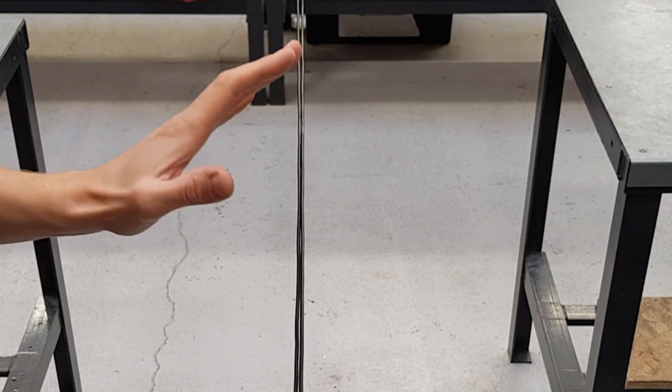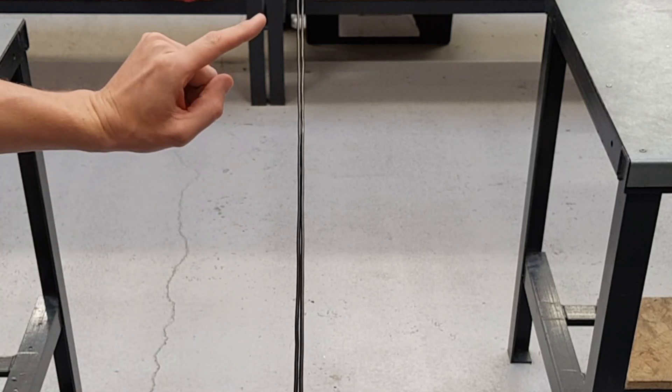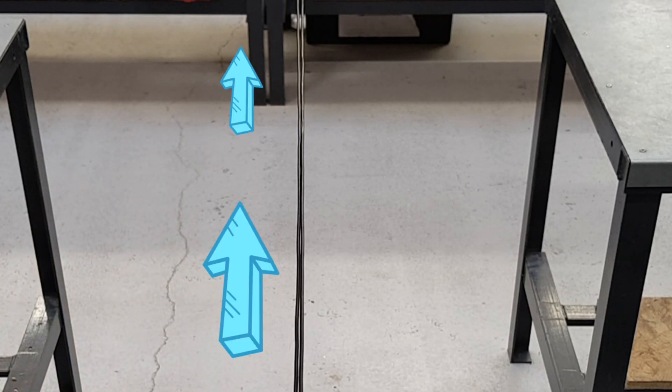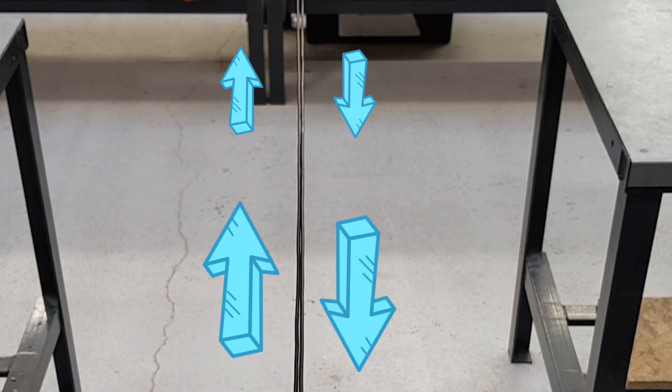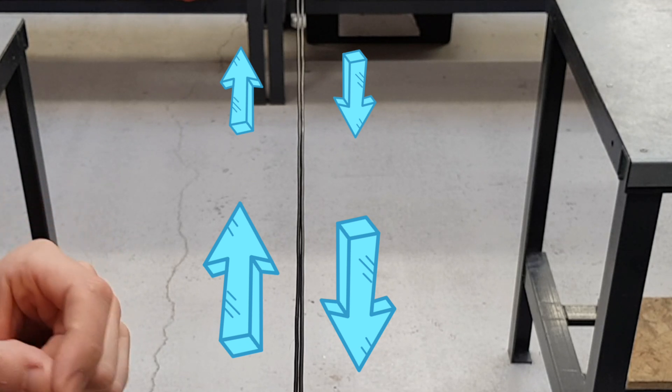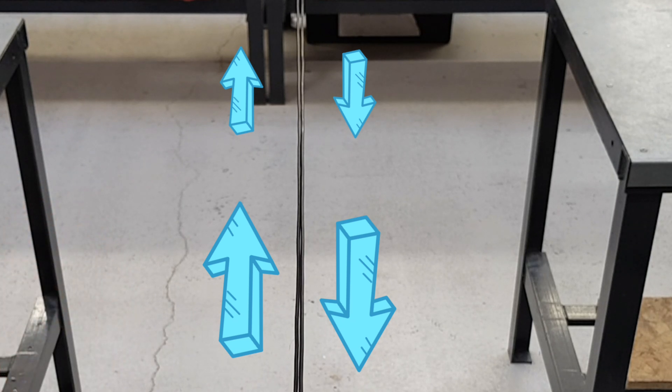So we've finally got this set up and I'm confident that this is going to work now. So what we've got going on: we've got two conductors that are strung next to each other, very close. We're going to run DC current through these conductors. The current is going to flow down this conductor away from us and then at the far end it loops around, and the current is then going to flow back down this conductor towards us. So we should see a reaction between these two conductors when we put the power supply onto this. We're going to connect up the DC power supply and see how the cables behave and then explain what's going on.